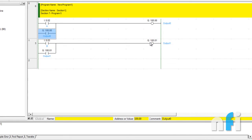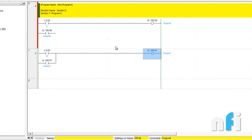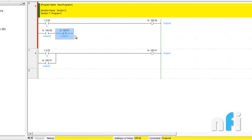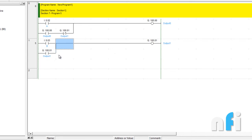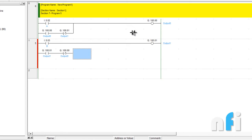To accomplish that, we can use the NC of each output coil to unlatch the other. Delete this line and put the NC of coil 100.1 here. Put NC contact 100.1 in the first rung. Similarly, delete this line and put the NC of the upper coil 100.0 in the second rung. That's how you do interlocking in PLC circuits and in hardware relay logic as well.